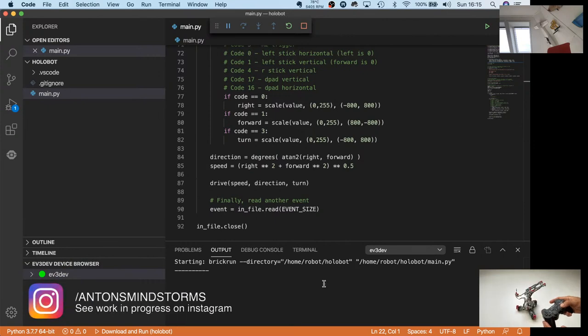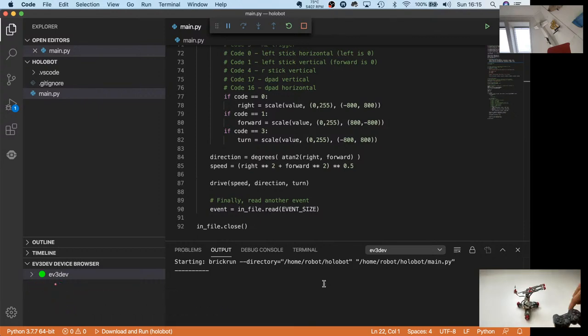This generates a negative number, and negative for our motors is going counterclockwise, so it turns the robot counterclockwise, so we will have to flip that around. But the cool thing is we can drive and turn, and it goes every direction. So now let's move this turn rate around. And what you can also see is that when I'm not moving the sticks, it's shaking.